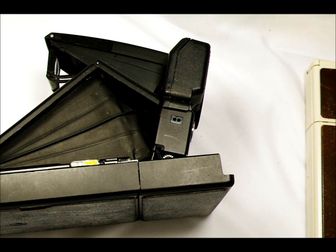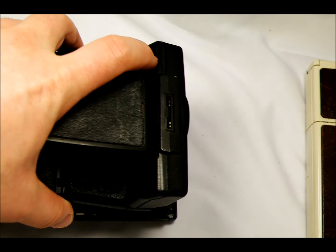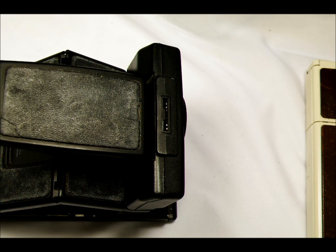The battery is a 6-volt flat type zinc chloride battery, and it's that type because it's the only thing capable of providing the pulse demand required by these cameras to function properly. The battery powers everything on the camera: the sonar system, the flash if it has one. The flash bar uses M-type flash bulbs, and the flash sync speed if you're using an electronic flash is 1/75th of a second.